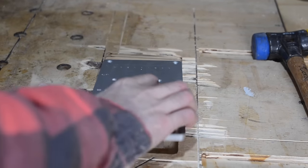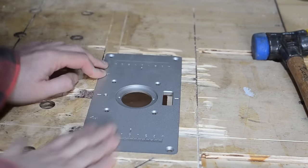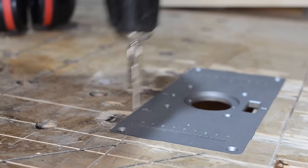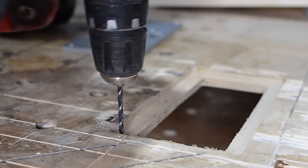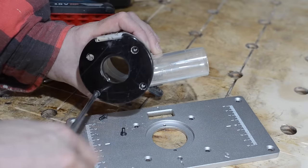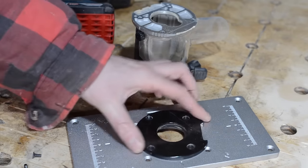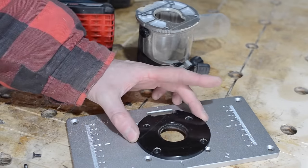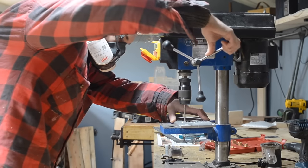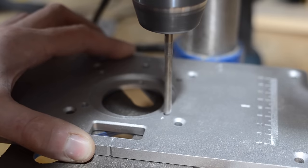With that done I can test to see if the plate fits on that shelf and it's a nice snug fit. The plate came with some nuts and bolts so I use a self-centering bit to drill some pilot holes and then widen those holes up. I want to attach my plunge router base to the underside of this router plate — it comes with some pre-drilled holes but none of them line up, so I use this plastic plate as a template, mark out where the holes need to go, and drill through them with the drill press.